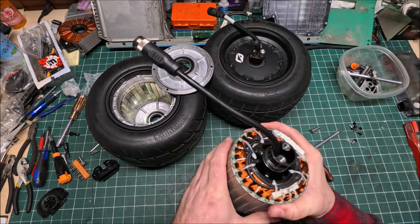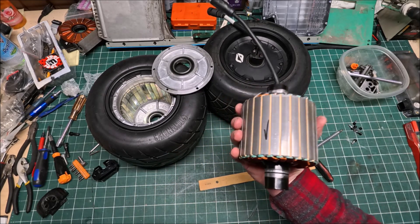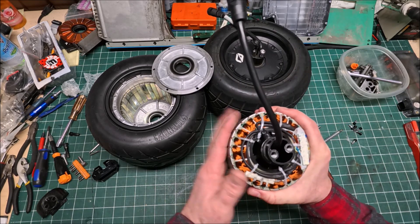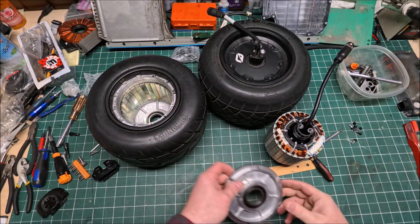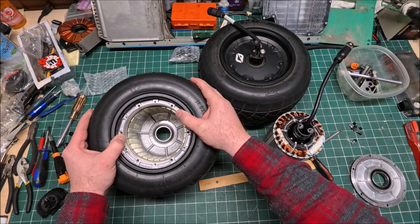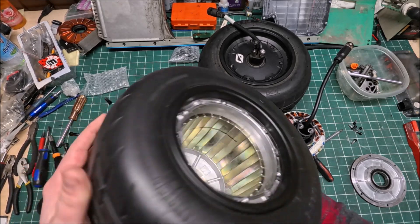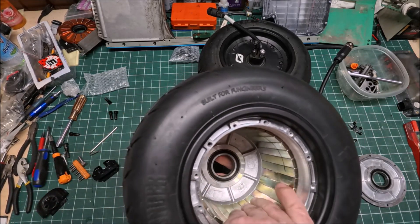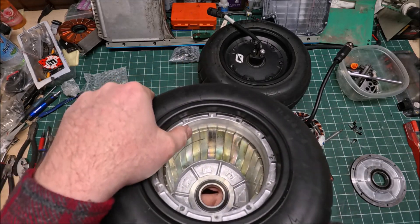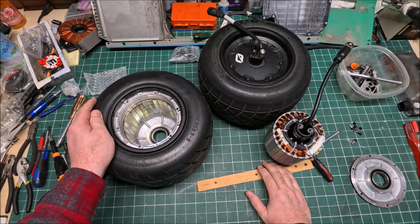Those three are the phase wires. Like I said, the motor — especially holding it in your hand — feels like five pounds or more. The stator looks really impressive. As for the magnets, I don't have any tester to check how strong they are, but they look all right — they look like they've been glued in the right place at the right height. I hope it's going to work the way it should.